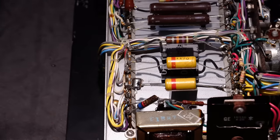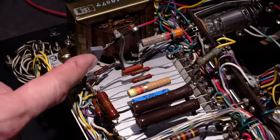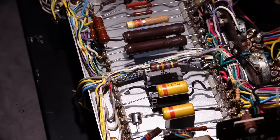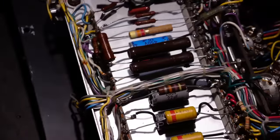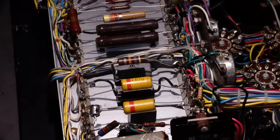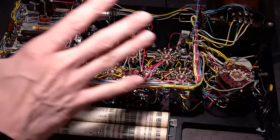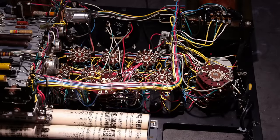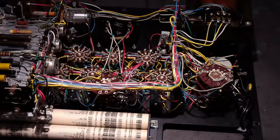Some square-type capacitors were used for replacements. The filter capacitors they replaced use IC — Illinois Capacitor — which is my preferred capacitor. They're all IC. There's a 10µF 450V blue one down there, all looking good. The issue is two of the switches here don't function properly in a position. Also, the leakage scale from position two onward shows resistance when it shouldn't — that's very common for these particular testers, and that's where the modification comes in.